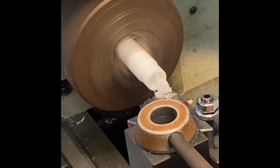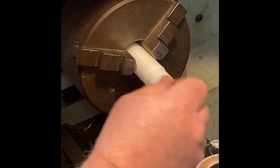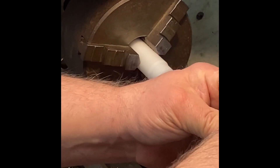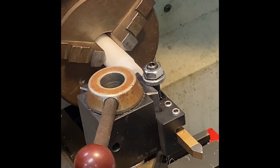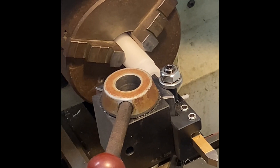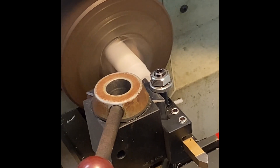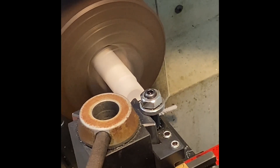Back to the center and out of the hole — I should be good to go, and that should fit the person's finger. Now I want to chamfer this, so I'm going to remove my boring bar and put a chamfering tool in. This is a 45-degree chamfer using a brazed carbide cutting tool — it's kind of old-fashioned, but I just need to chamfer the OD and the ID. I'll come in, touch off, and move about 20 thousandths to give me a 20 thousandths chamfer on both the OD and ID.